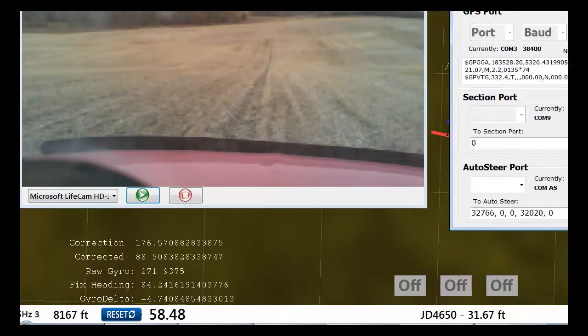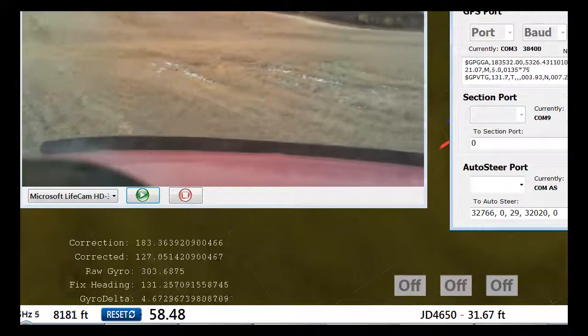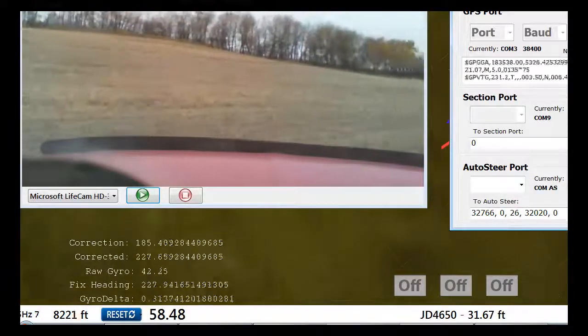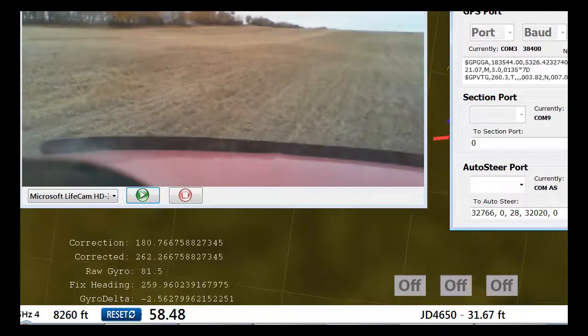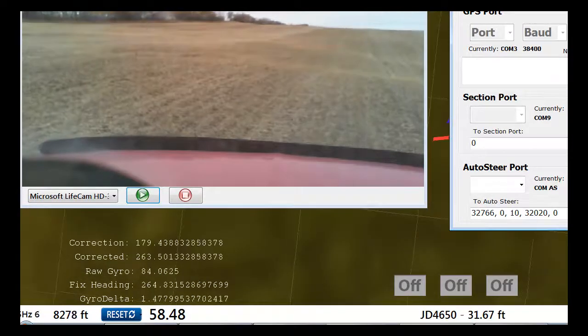Here's the raw data. This number here is the raw data in 16 times the degrees — so if you take this integer and divide it by 16, that gives you the angle in degrees you're heading.